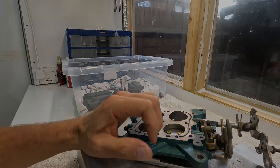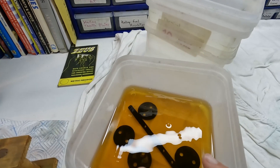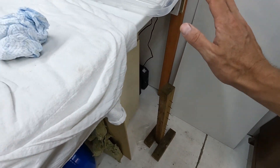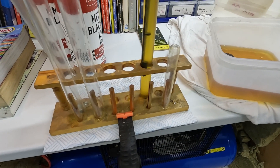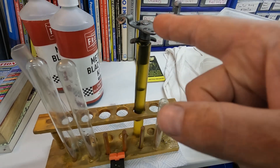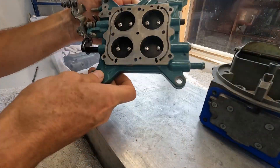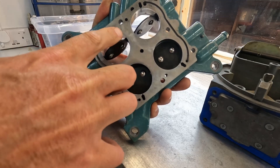Some of you might find this helpful: I'm doing the final stage of the chemical blacking process — these parts are marinating for about 15 minutes, then I take them out and air dry them overnight. I've got this Heath Robinson contraption which I use when I only want to do part of the shaft, doing stage three of the process just to the shaft because it's very difficult to include the top bit. That might be a little tip you guys want to try. Here we go — here you can see the base plate completed.